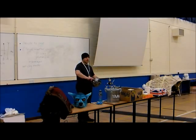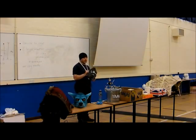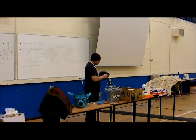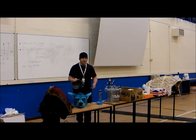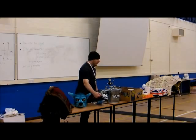When I say clean up, I mean like cutting the outside. Because the problem is when you cut it too far, it's hard to make a mould of. You want a lip, basically, all the way around. Always. That's the other thing. When you're sculpting something like a helmet, come in and then make a little lip. Because then when you're making the mould of it, you're not trying to mould around a corner. You don't want to mould around something like that. You want it to come down, step in, then go down again for really far. It just makes life so much easier when you're doing moulds. Anyway, that's all.